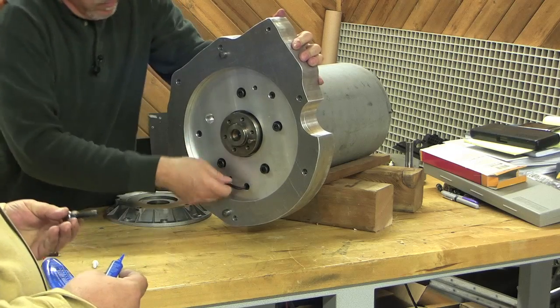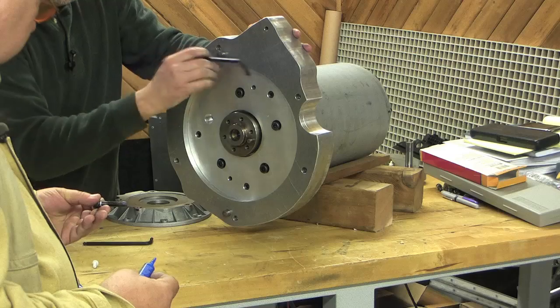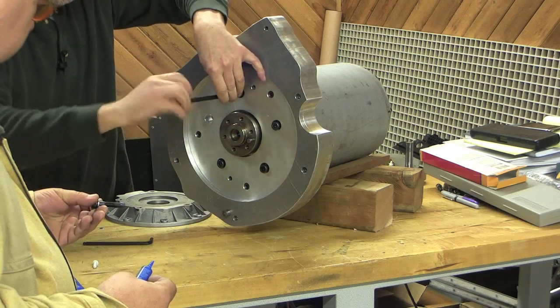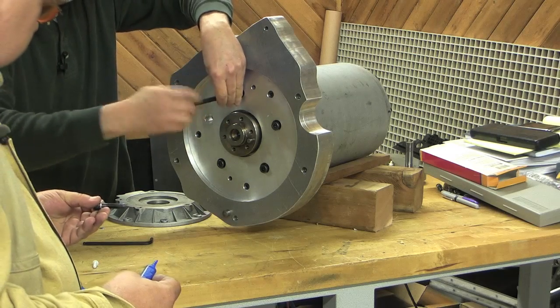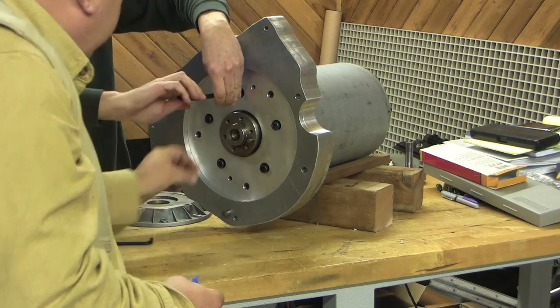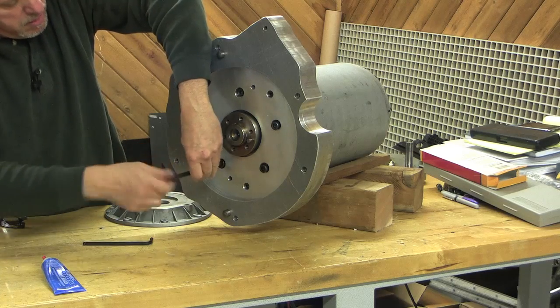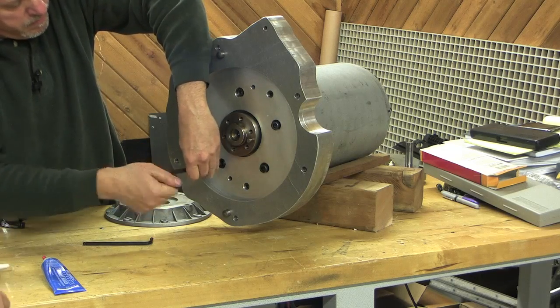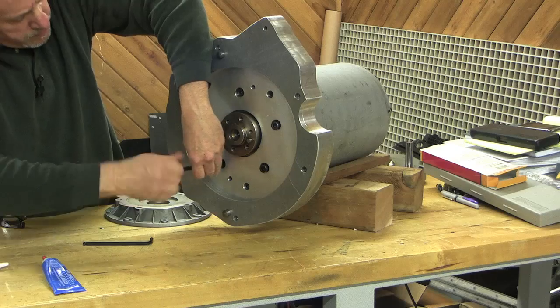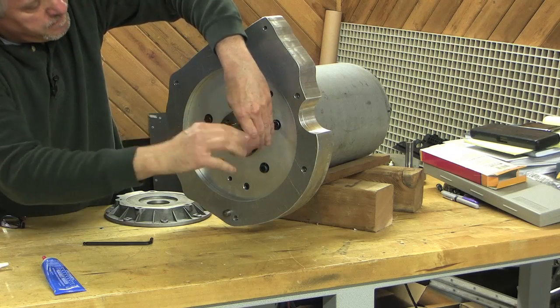But I don't normally consider an M6 bolt a mounting bolt. I'm going to draw this up with these bolts now — take some stress off those M6s. Let's start talking about our M8s, which for me in an application like this would be the minimum size mounting bolt.